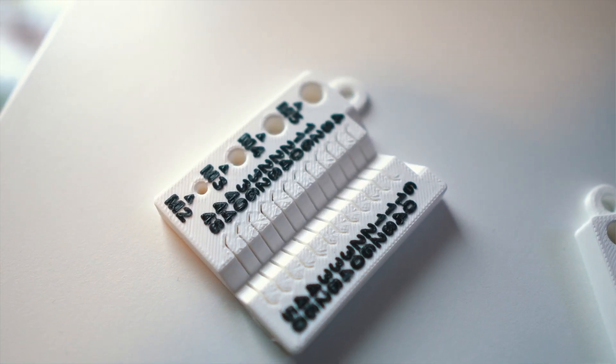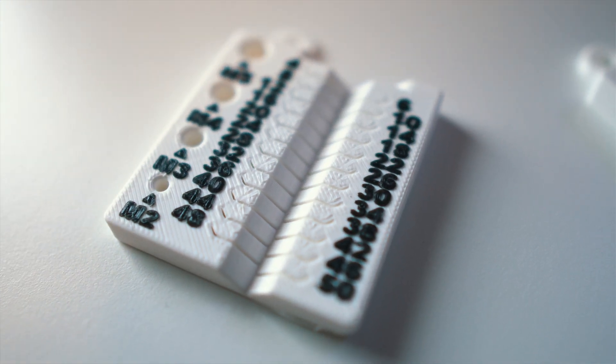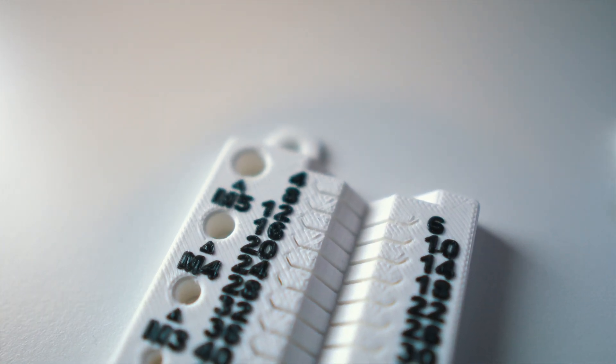Of course this is a very simple example. I used the same filament type — PLA in this case. I believe you can even mix different filaments in this process, but then you have to deal with temperature changes and printer settings for the new filament — I'm not 100% sure how you do that, but I know it's possible. This is not a method for large projects with many color sections — it's perfect for this kind of project where I only had one change, about six layers before the end of the print. Hopefully this was useful. If you have any questions, just leave them in the comments and I'll try to help as much as I can. Thank you for watching and see you soon.